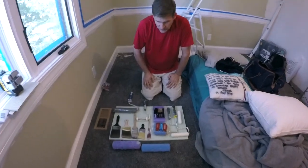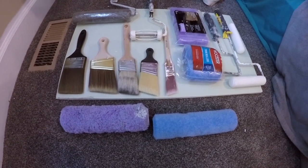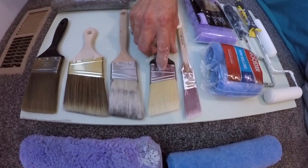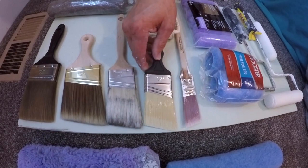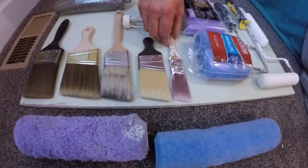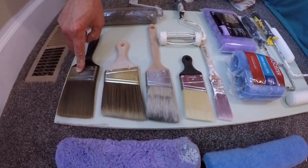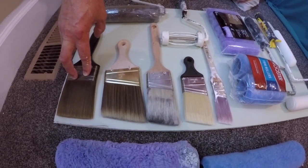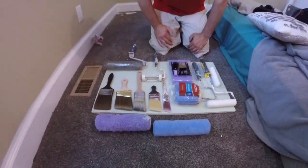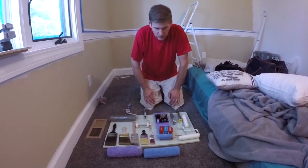Here's a selection of different brushes — this is just the tip of the iceberg. When you're painting, you need to have some kind of preference in mind. This is my favorite brush: a cut-in brush, angled with a short handle. Wooster is a good brand name and this brush will make a nice straight line. We're kind of partial to angled brushes — this is my brother's favorite brush, it's a one inch. This is a two inch, this is a three inch angled, and a three inch straight. They make them for stains as well as paints and in different bristle types depending on whether it's latex or oil. Typical wall paint is latex, so all our brushes have the bristles that are good for that.